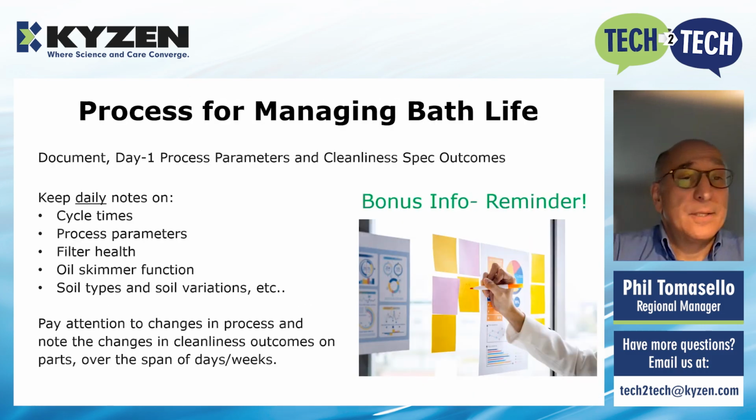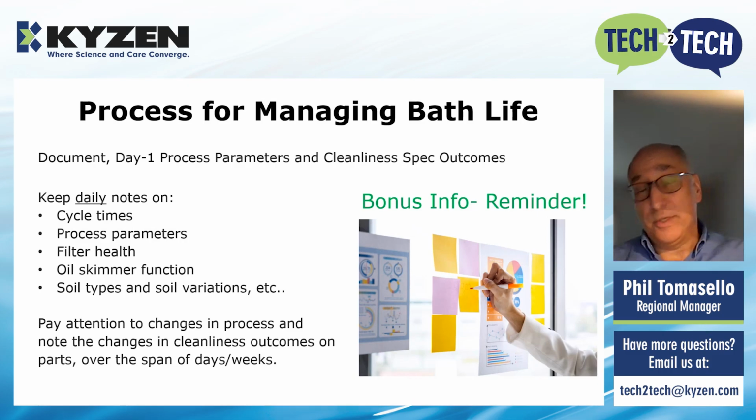I put in a bonus slide here just as a reminder for process management of bath life. Managing a bath and managing a machine from a cleanliness standpoint really go hand in hand. From day one, take a look at cycle times, make notes of the process parameters you have: time, energy, solvency, temperature, filter health. Make sure your oil skimmer or your coalescer is working. Identify how long it's running.